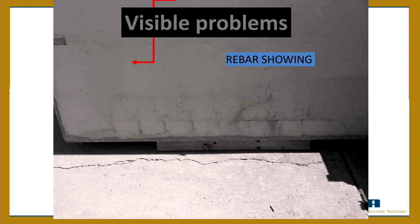It's early age cracking that can occur sometimes when the bleed water at the surface of the concrete dries up really quick and the surface kind of squeezes, it compresses a bit, so there's some surface cracks that can occur. These cracks are so minute in depth, they're very, very shallow, and they're not going to pose an issue to durability of the concrete. If you got to go right up and look at it like this, if you see that sometimes, that may not be an issue, okay? That's a drying shrinkage crack.